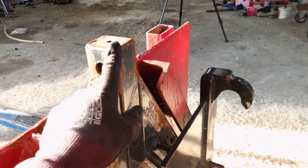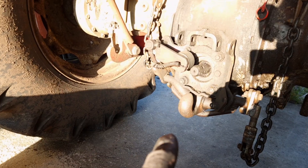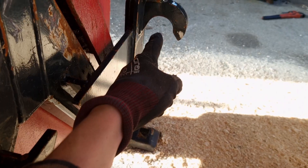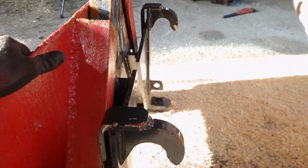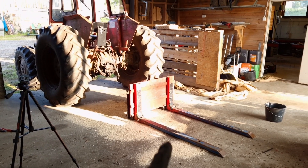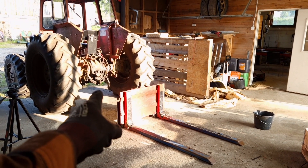What I'll do is make an adapter for the three-point hitch on this tractor — an adapter that goes inside of these. We'll need some type of pipe through here, and then we'll just need to weld on some flat bar or something that can connect to those. In order to lock it, I'll just use a pin, and then we'll need to support it with something to make it sturdy. That's the plan: get those forks onto the three-point hitch.